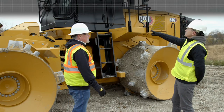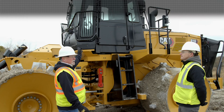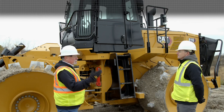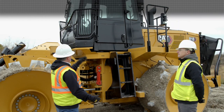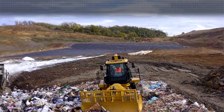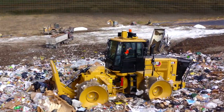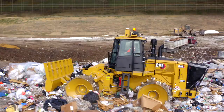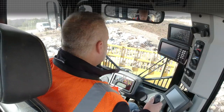Since we're talking about the cab, let's come down to the window guard. We call it the face mask — like the face mask on an American football helmet, it doesn't block visibility but it protects the face. This protects the windows in the same way. We keep the bars small so material can't get through and break the windows, but visibility is still excellent for the operator. When you put a screen over the window, sometimes the sun deflects and you get shadows — a lot of operators get headaches or their vision gets blurred and they get fatigued more easily. This way they have the full clean window and perfect visibility.